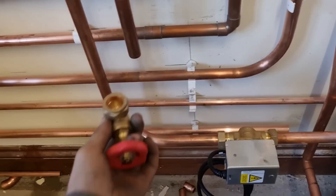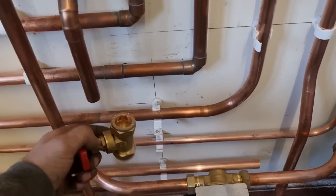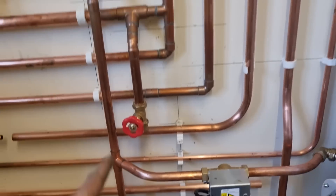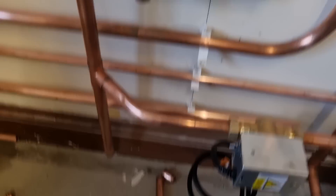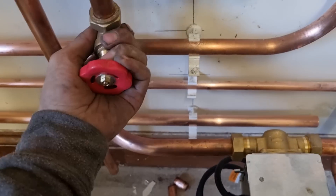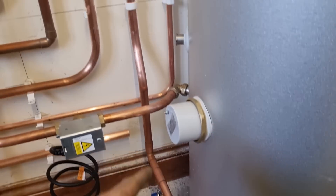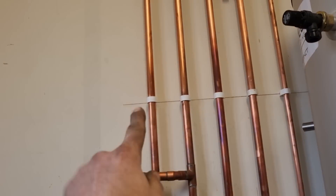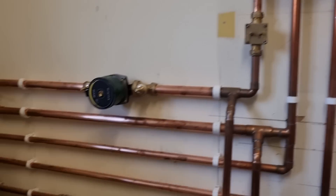I always put a gate valve on the primary return — it's the only thing I use gate valves for in plumbing. What it does is let you balance the flow down through the coil, because you don't need full flow through it. If heating and hot water are on at the same time it can rob heat through the coil, so you can dacker it down like a lock shield on a radiator valve. I'll jet-blue that up, pick up the bypass off there, pipe the return into that one, and then hot's done. Just expansion vessels, PRVs, and a fill loop to go.